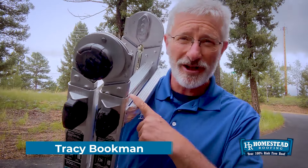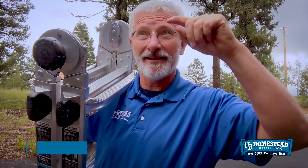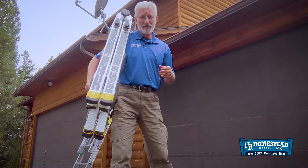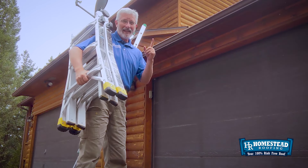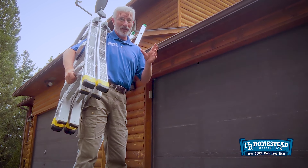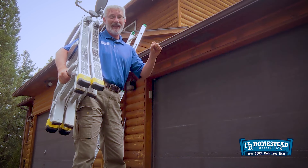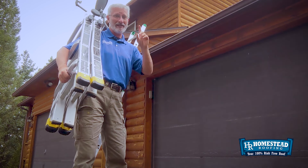Either way you do this, you're going to need a second ladder. Depending on how tall the distance is between the second story and the first story, that's going to dictate what size ladder you take up. I'm a firm advocate that the smaller ladder you have to carry the better. Now it's not really possible to climb the first ladder while holding the second ladder in the manner that OSHA tells you is safe — meaning you have three points of contact on the ladder at all times: either two feet and one hand, or two hands and one foot.